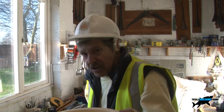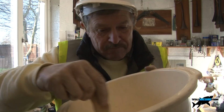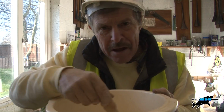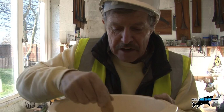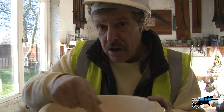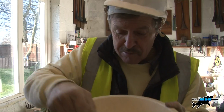And then just get yourself either a brush or a little spatula, mix it all together like that, and just paint it on with a brush. Let it dry. Give it about 12 hours to dry off properly, 12-15 hours depending on the temperature of the place. And then over you go with the Artex over the top. Now it's all mixed together already, nice and creamy.